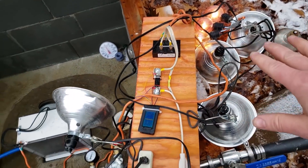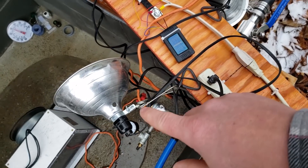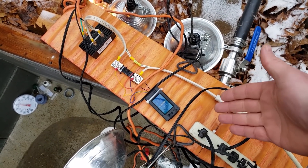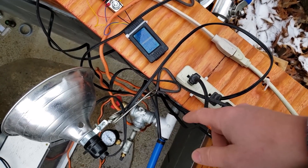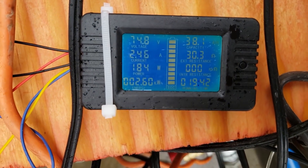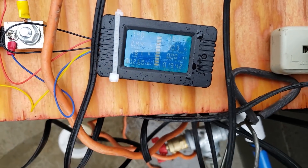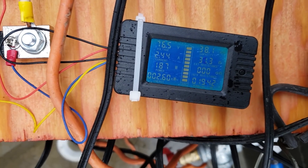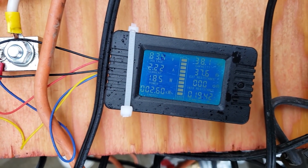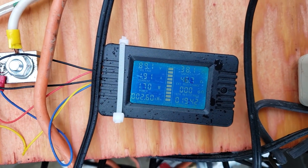I have a whole bunch of lights rigged up here, and these lights are just acting as resistors that produce light — that's what incandescent bulbs are. If I turn this lamp on, you can watch the watts decrease because it's drawing too much current and the turbine's going too slow to be efficient. I can turn it off and it stabilizes back at 185. Then I can turn other bulbs off and it'll run faster, higher voltage, but less current.